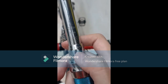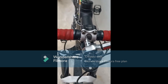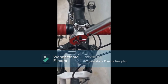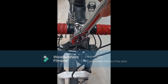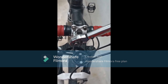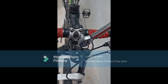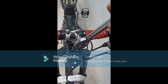I can see this one here — so 5Nm clockwise. Let's see how it works. Put this in here, make sure it's snug, and then you start cranking it until it clicks. You can see it's starting to click. Make sure the bit is all the way in so you don't round off the bolt.